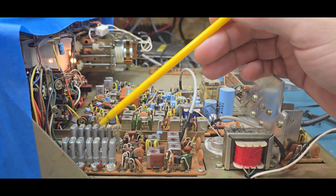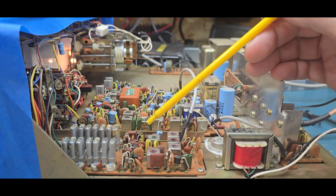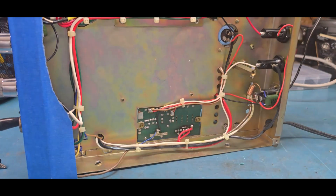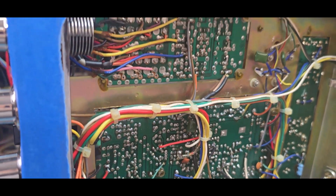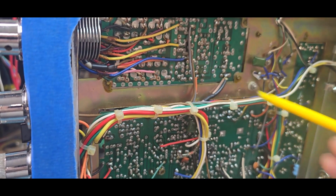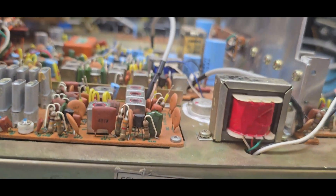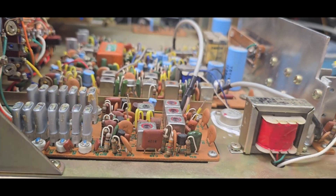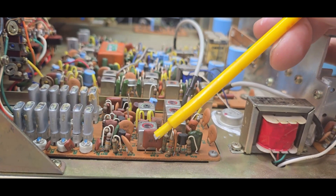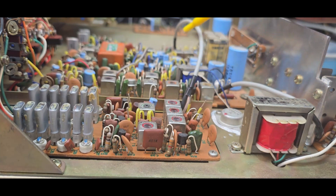The channel selector will select two crystals to mix, and in this particular mixer the sum of the two is what goes over to the rest of the circuitry — out to the receiver. On the bottom of the radio there's another cable right here that goes off to the transmitter side. This point is the exact same spot as we have on top.